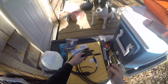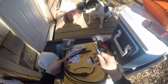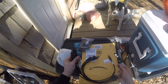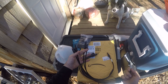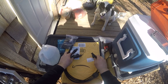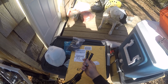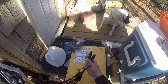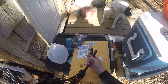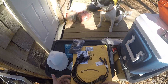I'll put all four panels into this side and it feeds into the single one here — one side being negative and the other side being positive. So all four of my panels will feed into this connector on the positive side and then feed out here. With these two connectors I can run to my charge controller, and this increases amperage rather than increases voltage like I have them set up now. So let's get that taken care of.